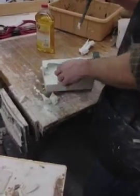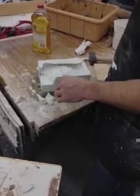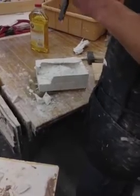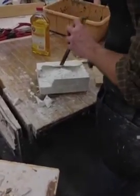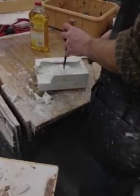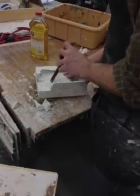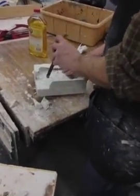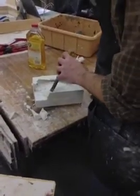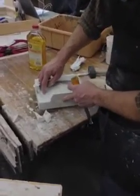What that will do is keep your chisel away from your cast, because it's going to snap before your chisel hits. If you're hitting it too much to stop, you might have put it in the wrong spot. For example, if I were to put it over here, it wouldn't snap very easily, right? It would probably end up touching the cast. So I want to be way out here towards the edge and let the plaster break where it wants to break. If I break it here, it might go across like this, right?